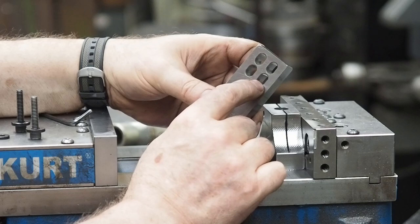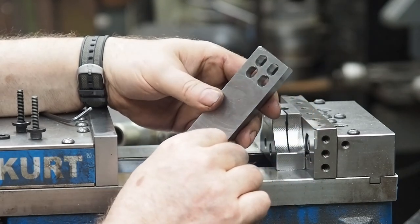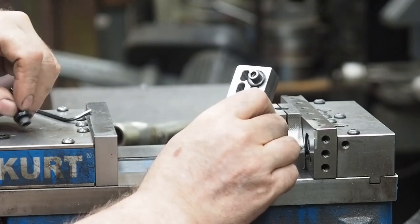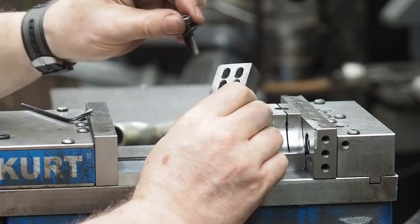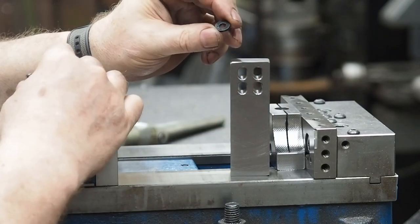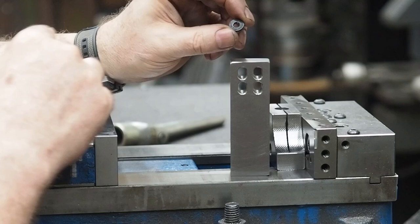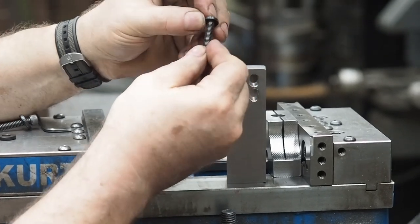I just had to begin with on my first block, I did just a regular screw hole in there. But I have to make these so they're adjustable so I can use them over and over again. One of the problems I run into is there's a half inch hole spacing on all that. So if I put in a screw using a standard hardened flattened washer like this — it's a 5/8 diameter — if I put another one in there, there's an overlap so I can't use the washers in it.